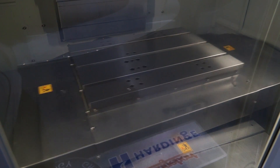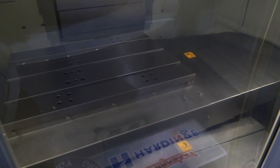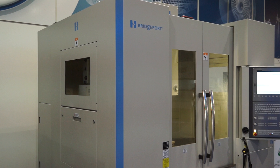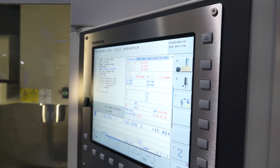The Y-axis is also a key factor. A lot of engineers buy a machine based on the X-axis but often interrogate the Y because they need that stroke as well. What's the Y-axis here? This one is 415mm in the Y, so for a 600 machine that's quite sizeable. We carry these machines in stock — yes, certainly. We have a number of configurations ranging from the 480 to the 1.6 metre, with a variation of controls: Siemens, FANUC, and Heidenhain. All machines are retrofittable with swarf management and probing.